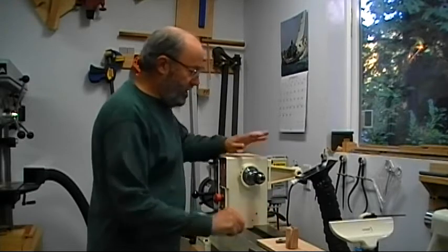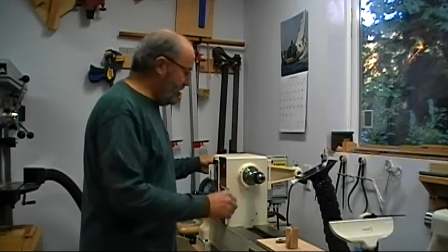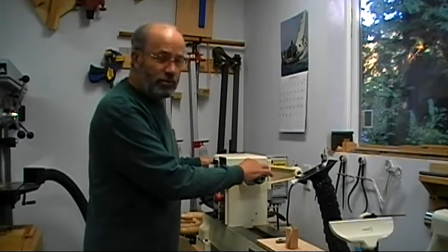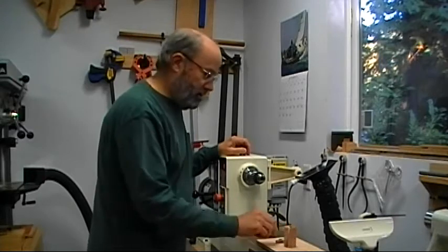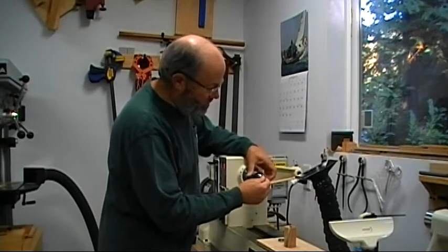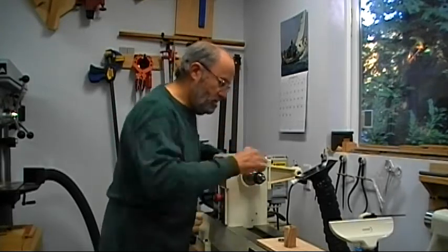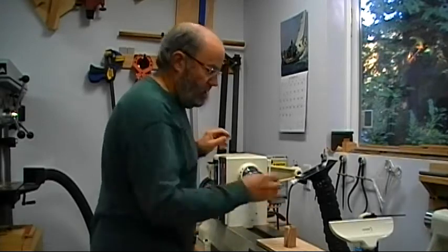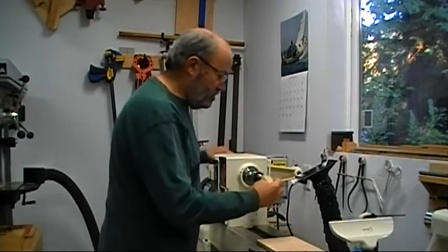Okay, we're ready to mount the blank onto the lathe. To do that I have a Jacobs chuck in the headstock of the lathe, held on with a drawbar which prevents it from coming loose in the morse taper — just a little safety device. For some of the turning we'll be doing, we won't be using the tailstock at all. We insert the mandrel into the Jacobs chuck and tighten it down nice and secure. Then the sizing ring goes on so we know how far down to turn it, and the threaded hole will just screw right on.